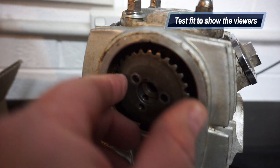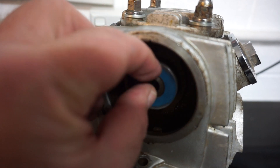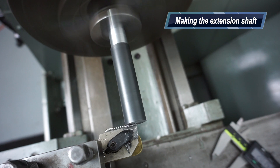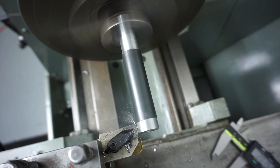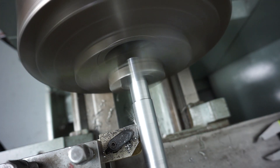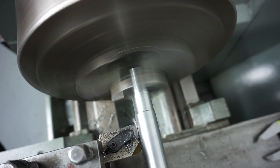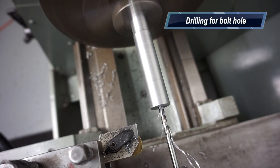Here are the discs I've made - just a test fit to show where everything goes. That's where the cam gear locates and my extension will come off these discs; the disc sits on the camshaft. This is just some basic turning, facing, parallel turning, centre drilling, parting off - just some dirty black bar I had in the shop, with simple OD turning and drilling the hole which had to be tapped later to M6.